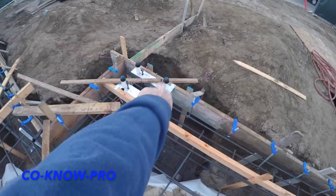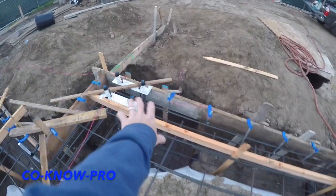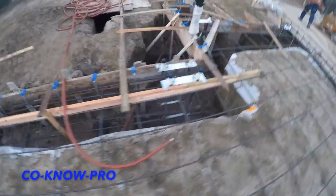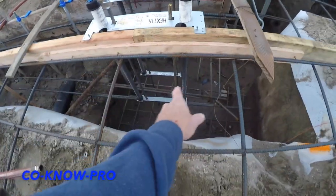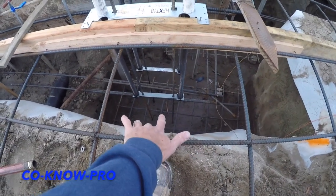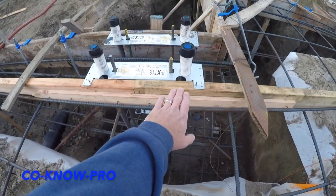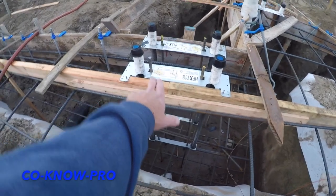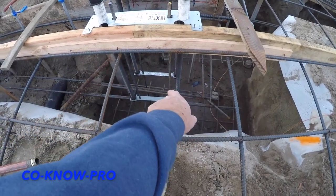These are our double strong walls — these are hardy walls that are staggered. Those walls are staggered for structural per design and layout. You see this hardy wall, you see this rebar right there? That's a stiffener — it goes down and that rebar is nailed into the ground just while the concrete's being poured. Then when the concrete reaches all the way up to the top, you pull that bar out of the ground so you don't have rebar sticking in the ground. It's just there to keep the bottom from flopping back and forth during the pour.